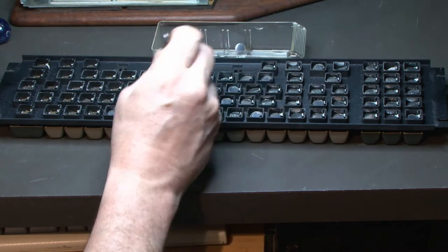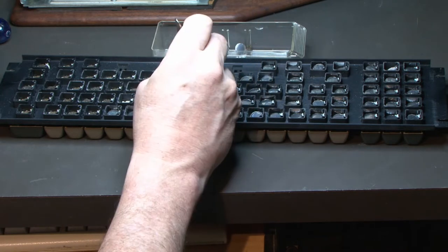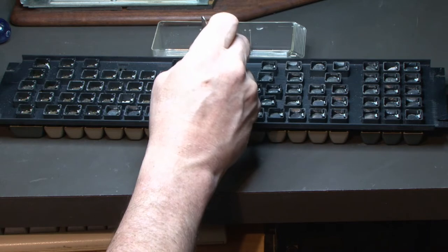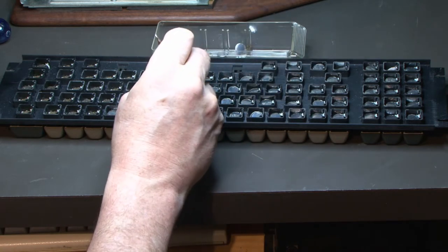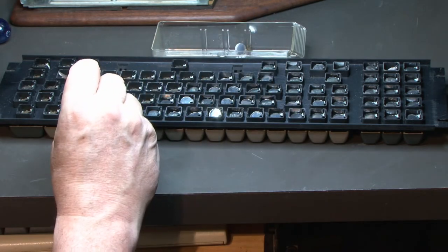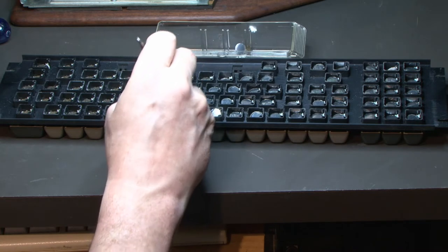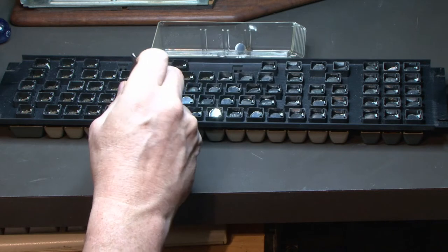So I don't know if we can measure the capacitance. Maybe if we throw an oscilloscope on the trace or the contact and then apply some different materials, like one of these original pads or even a 15 picofarad capacitor across, and see what it does on the scope, and then we can try different materials and compare that.